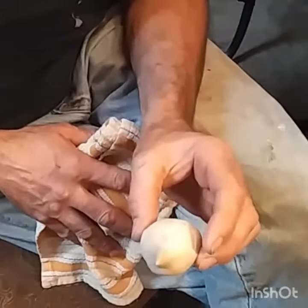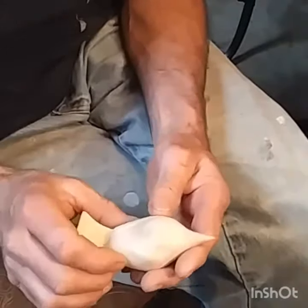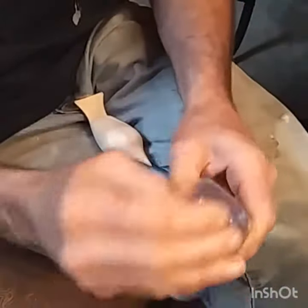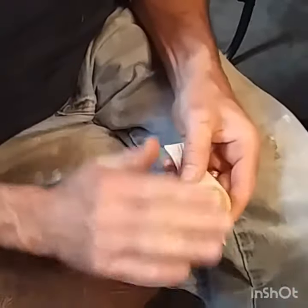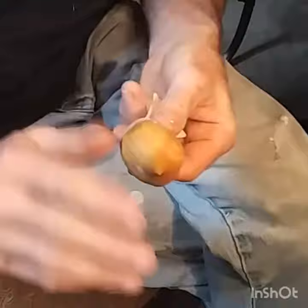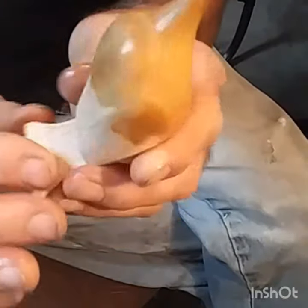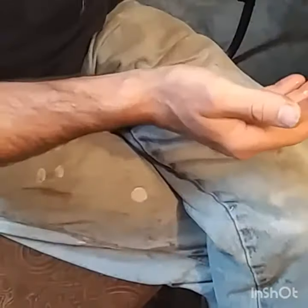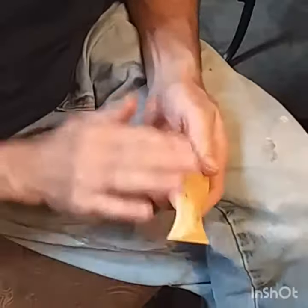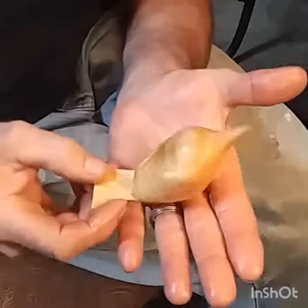And like I said, this basswood doesn't have a lot of figure in it, but we're going to put a little bit of mineral oil on it to seal it and bring out what little grain is there. And you can use sanding sealer or varnish or linseed oil or whatever your choice of finish is, but mineral oil will serve the purpose. Whatever you put on it's going to darken the wood, you can see. You see, it's got a little bit of grain. There you go. The comfort bird.